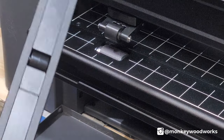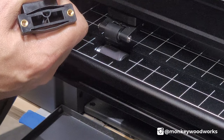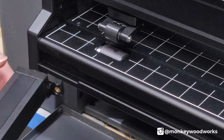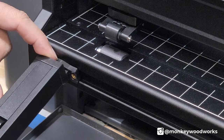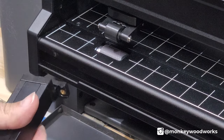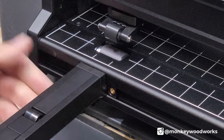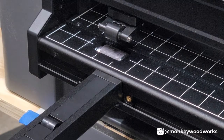The next thing you need to do is slide the arms into the frame of the conveyor. The ends of the arms have a plastic molding with some spring pieces on top and bottom, and those kind of lock it in place because they have little lips. The easy way to get this in here — you can push it down on the bottom first, use your finger to push down the spring, lift it up, and then push it in and slide it across. Or, since the spring is not on the ends, you can put it in at an angle, twist it straight, and it will automatically compress those two little plastic springs. Then you can slide it in here. Push the whole thing in at one time, and you'll use your short screws to lock this in place against the conveyor frame.